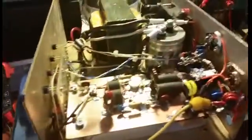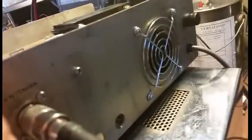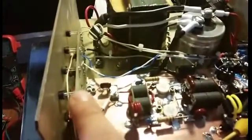There's quite a bit of labor hours in this unit. For the hole in the back, we went ahead and threw a fan in there — it's good to have some airflow. I put four portholes down here for the fan. This square mark here is just where that heat sink was sitting; I tried to rub it off but it's been on there 25-plus years so it's made an indentation. We repositioned the transformer, the single-phase bridge rectifier, and the cap — we pretty much stripped this whole unit down to bare metal.